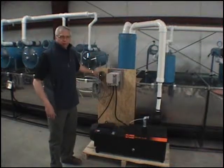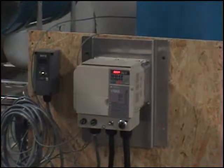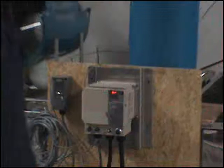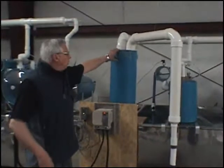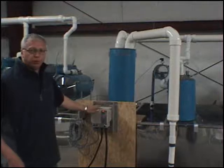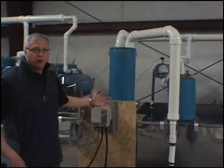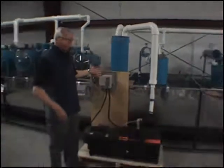The pump features a few controls that can be linked to the drive: a thermostat for auto start and auto stop with a set point that you determine, and a humidity trap with a switch connected to the drive for emergency stop in case of a malfunction of the releaser.